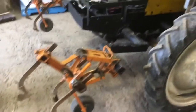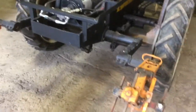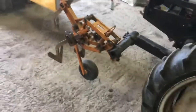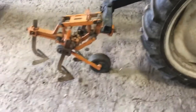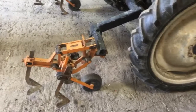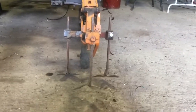So that's about what we have back here. We can see it's starting to get ready to go back out to the field. The rear weeding units are remounted, and that tool bar pivots to swing them down to the ground, and then their depth wheel guides them. They'll run down to that point, and then a little bit further, and then they'll all dig in and run flat, and just kind of scalp the surface in the tire track.